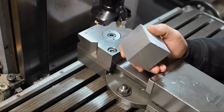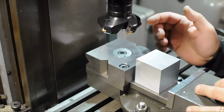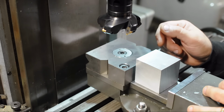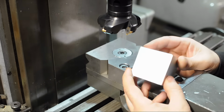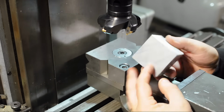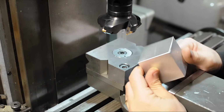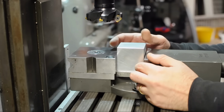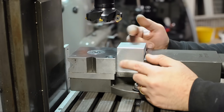And if you ask me, it's about time. You'll want to start off with the largest face. If you think you know why, leave a comment down below. Since this is a cube, it doesn't really matter where I start. This happens to have 5 sawn sides and 1 mill finish side. I'm going to start with this one up against the back jaw. And really for no particular reason other than that face is probably more consistent than any of my saw cuts.